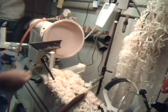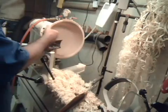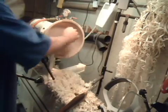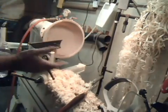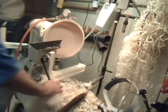I'd much sooner see you use shellac or Deft lacquer, or even the finish of your choice if you're going to finish with tung oil. Put a coat of tung oil in there on that tear out grain. Coat it all and then cut it away. That's not going to disturb it. I'd be leery of using wax though, I think. I don't normally use wax. I'll generally either use water or whatever type of finish that I'm going to use.